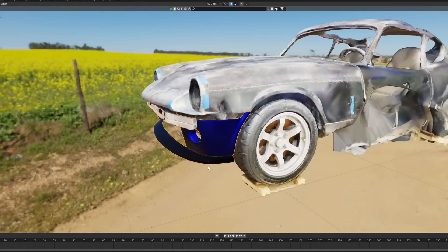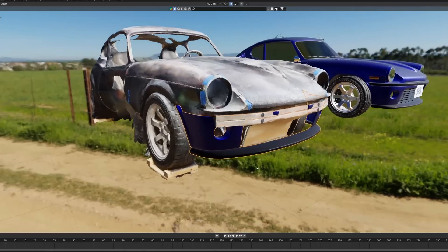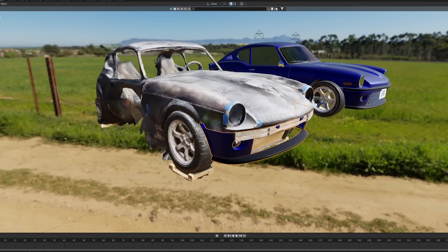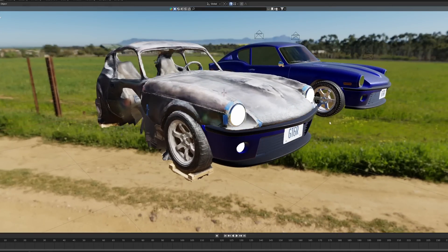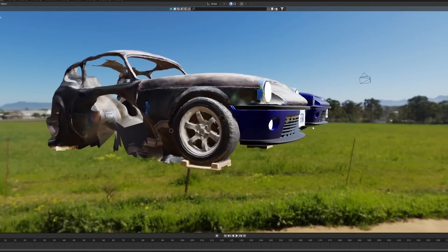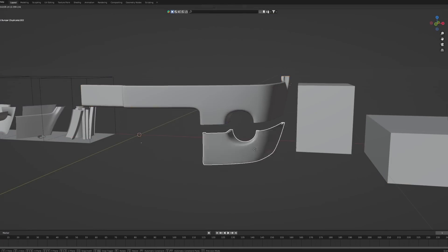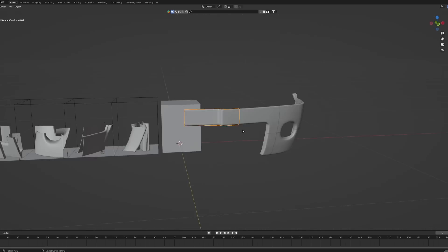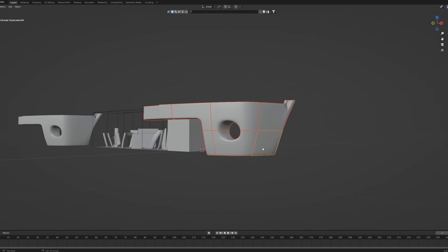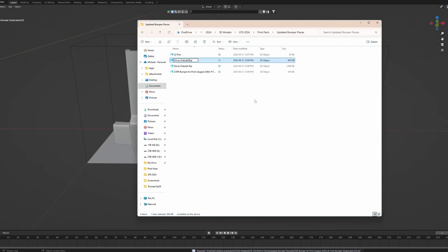When comparing this scan to the model I made earlier, you can tell we're off by a bit, but that's not really surprising. What I've done off-camera is tweak the shape of the bumper to fit the scan, and with that we're good to go. The parts are way too large for my printer to handle, but by chopping them into smaller bite-sized pieces, we can make this work with some glue. Material thickness has been set to 1.5 millimeters, and we can now export the parts as STL files, ready for use in a slicer.